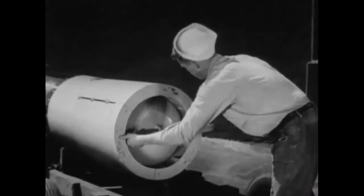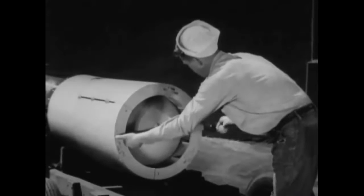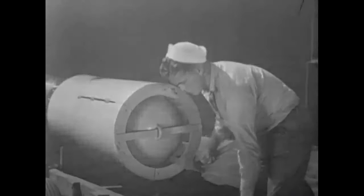The stabilizer is secured to the ring tail with wooden dowels which shear on contact with the water. The drag ring has two primary functions: to aid in air stabilization and to decrease the impact shock about 40% on hitting the water. This is especially useful in cases of extremely high altitude drops. In a torpedo drop, any deviation from true air trajectory is liable to cause damage on impact. The drag ring helps to eliminate pitch and yaw. Like the stabilizer, it disintegrates when it hits the water.